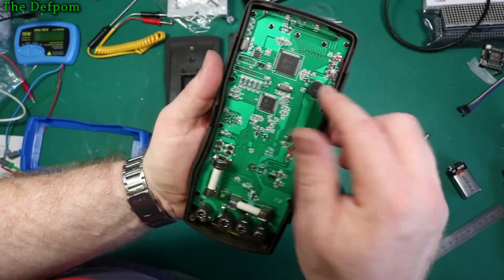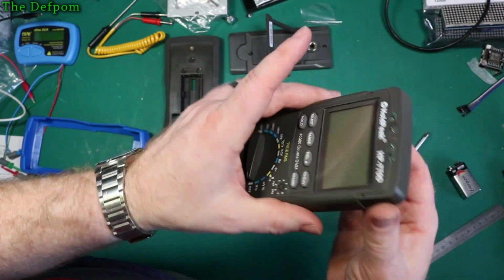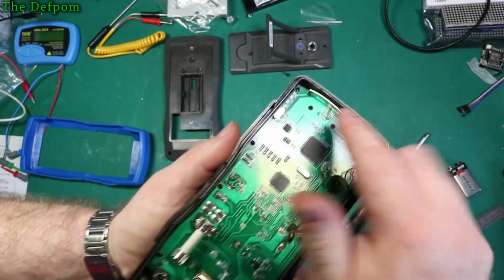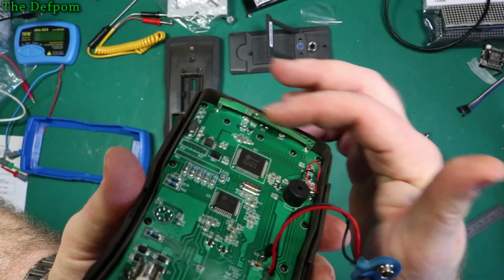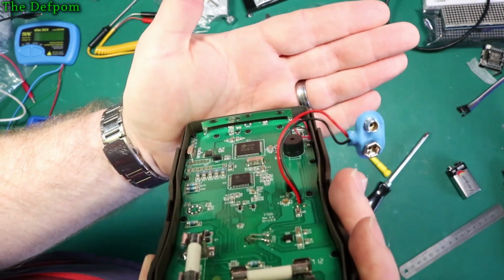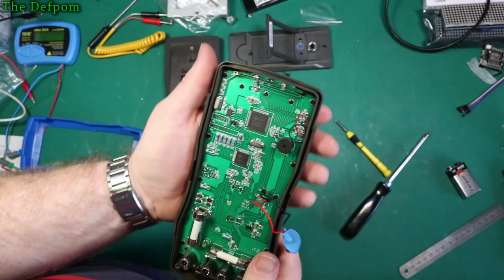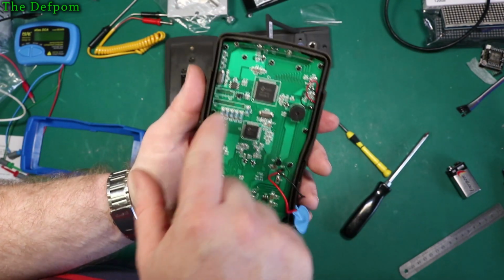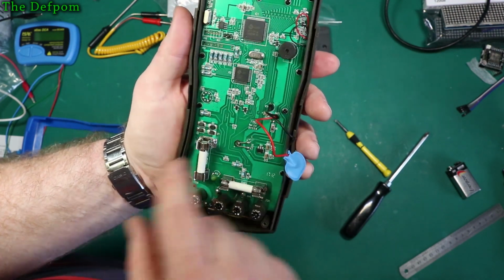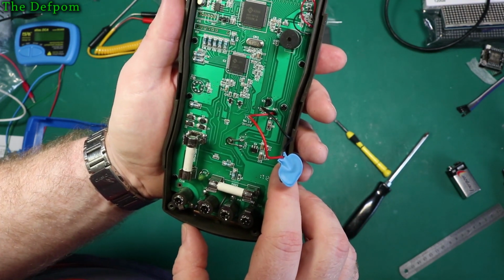So it's got a little buzzer there, obviously. Some little wire leads there for an LED, which must go around to the display LED. And there's the non-contact voltage sensor there. I see a bit of wire strip just there. So there we go. So it's also for detecting the high voltages. Some kind of programming header or something just here. That's also the transistor socket on the back there. Diode arrangement there. Looks like a diode rectifier actually. Bridge rectifier.